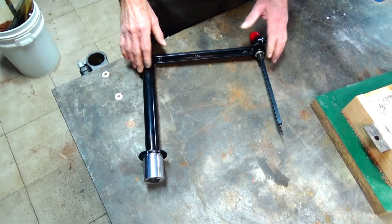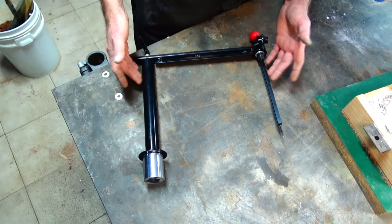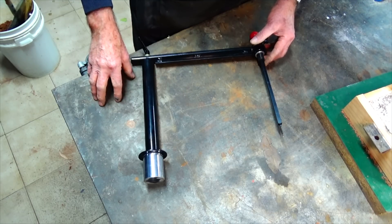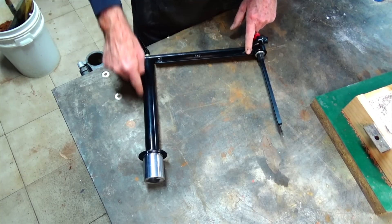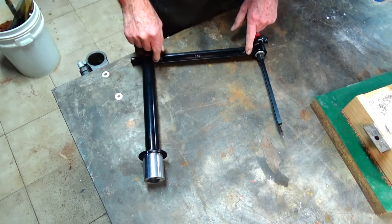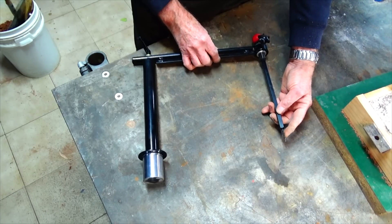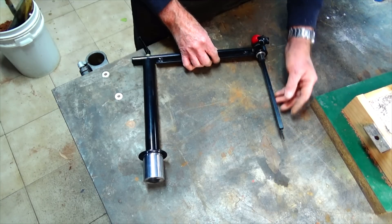The second method involves making a device, but it doesn't have to be as complicated as what I'm showing you here. Essentially what you need is a column which can be held rigidly against the surface of the bench, an arm which can pivot around the column but also move in and out slightly along a long axis, and at one end there's a piece of square steel bar with a screw point attached — and this can be lifted to pull the pattern out of the sand mold.